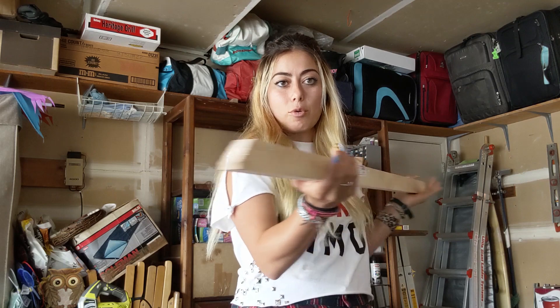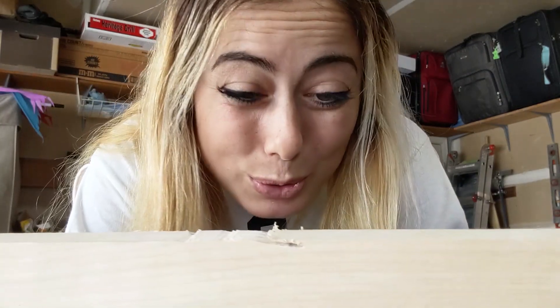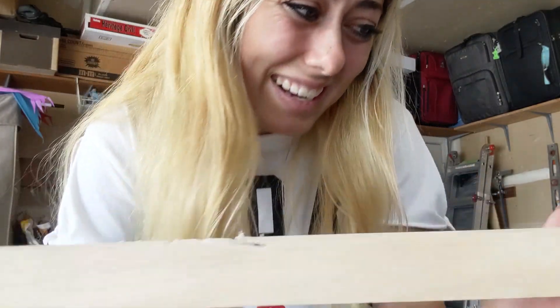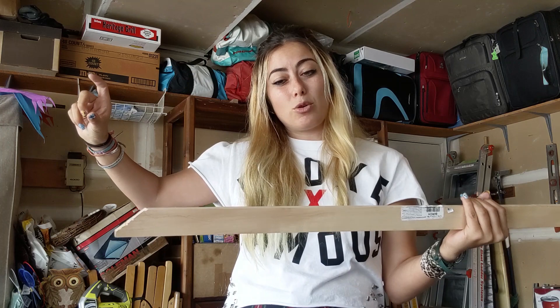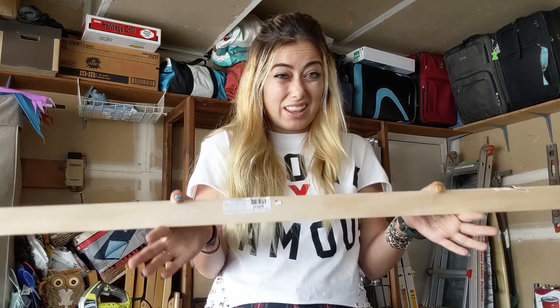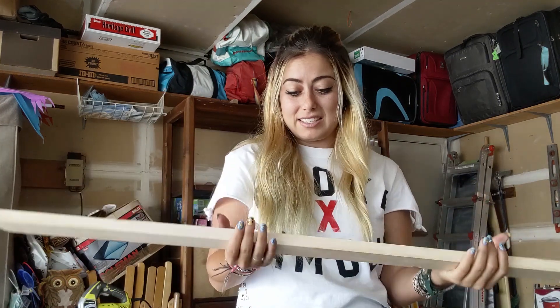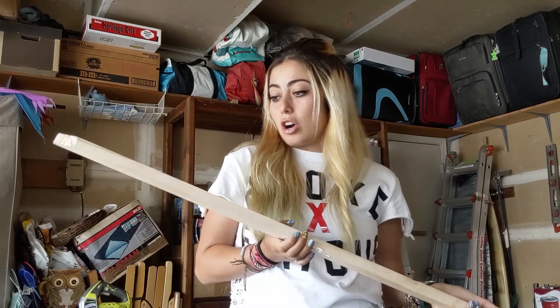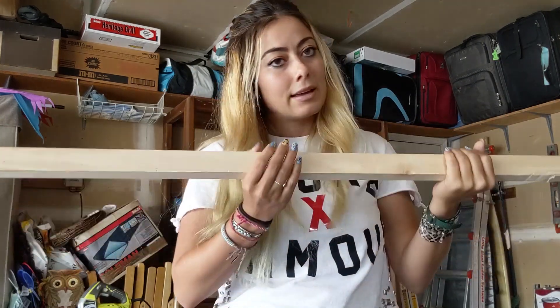Hopefully I'll figure something out. I've reached a potential solution. This is my 48-inch piece that I was trying to shape — instead of shaping it into one smooth curve to fit along the metal brace, I'm going to cut it into three sections: a bigger section in the middle where the ceiling is relatively flat, and two shorter sections on the sides. I'll just screw them in individually since I can't think of any other solution that isn't incredibly time consuming.